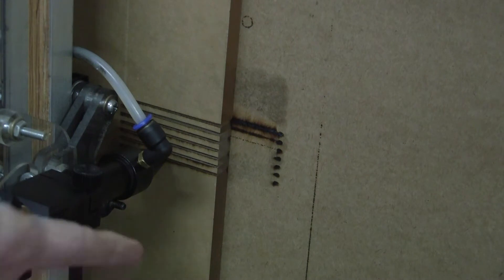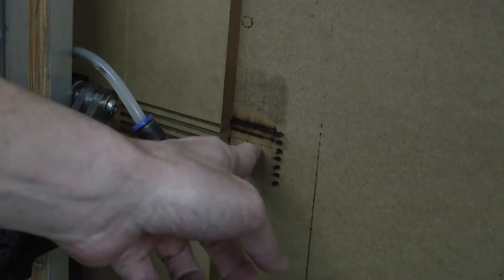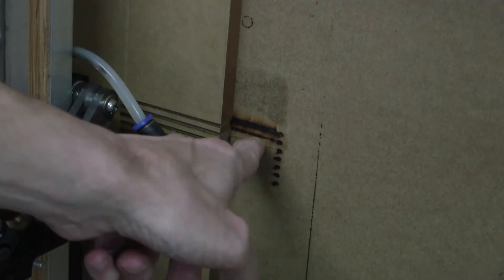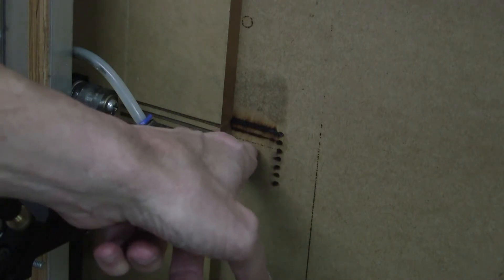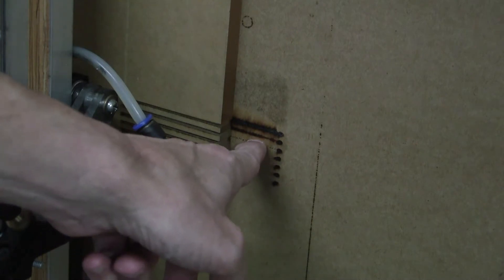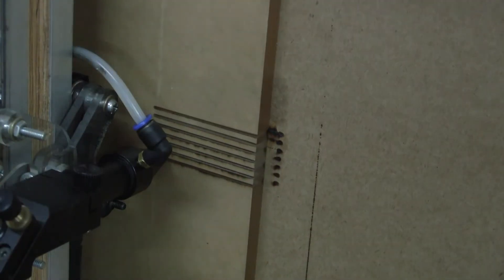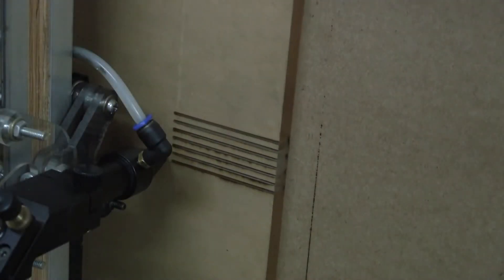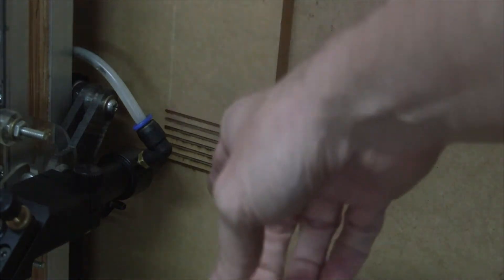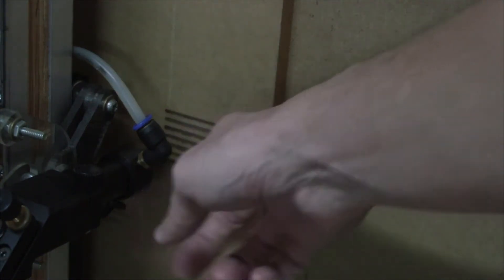It's pretty evident that the first few cuts did not go all the way through. This is 2, 3, and then 4 — 4 seemed to have almost gone all the way through the material, but 3 definitely did not. I'm going to try again with 2 passes, no refocusing and no change of the distance of the nozzle to the workpiece.